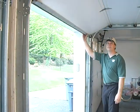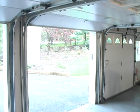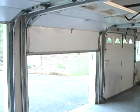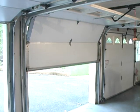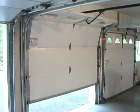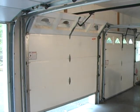To check the balance of your garage door, there are a few things you have to know. First, never disconnect a garage door from an existing opener unless the door is in the down position. If the door is not balanced properly, it could come crashing down and cause injury.